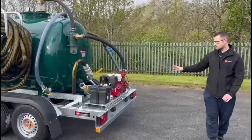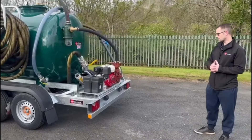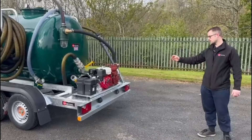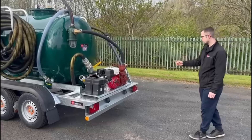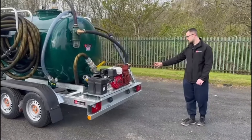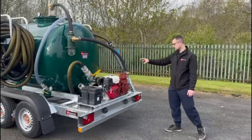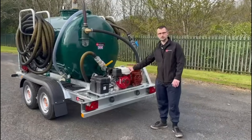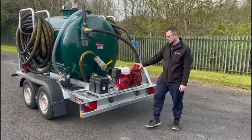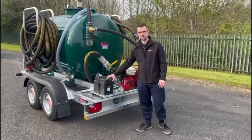The customer wanted all petrol engines so we've gone with the Hondas. Here on the back there is a Honda GX270 that's driving a Mech 2000 vacuum pump via twin belts, and all the belts are secured nicely inside the belt guard. The petrol engine has an electric starter and it's got its own 12 volt starter battery secured in its own battery box.